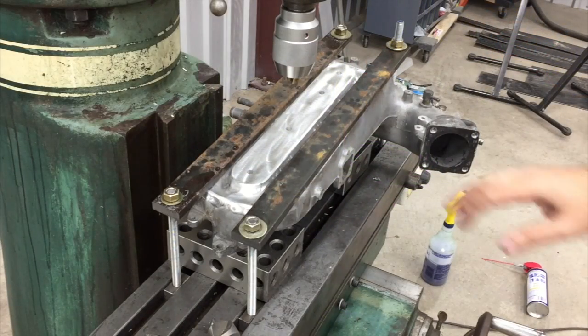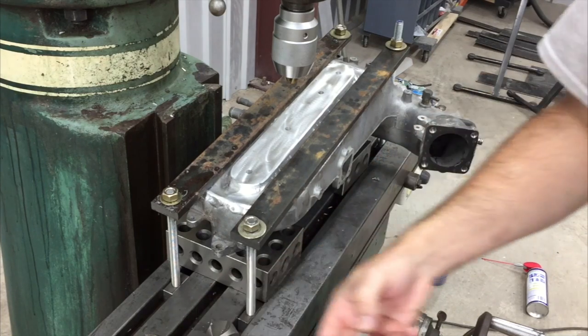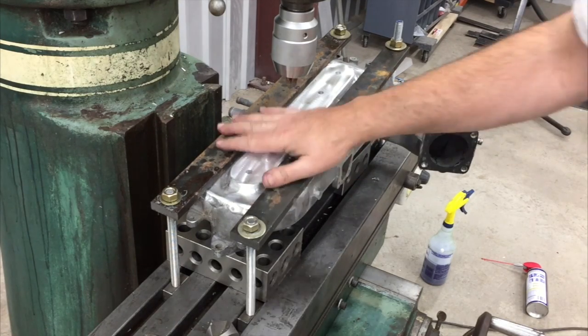All right, well, as you saw, we got this 3/8 inch bar fitted up, and I went ahead and welded it off camera, and had some problems with it because of the thickness of it and the limited power of the Eastwood TIG 200, but we got it on there. And you see we got two big straps. Had to also kind of come up with a tricky way to get this fitted in here.